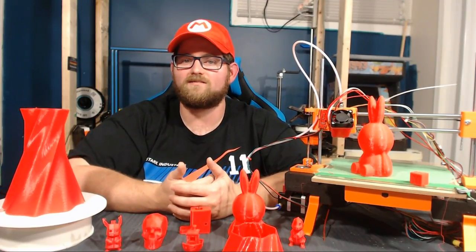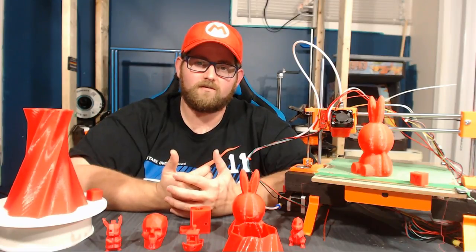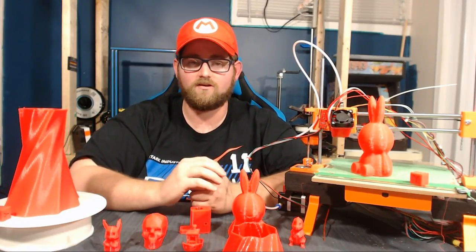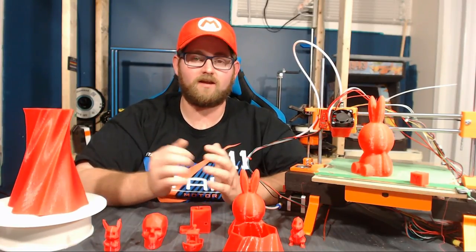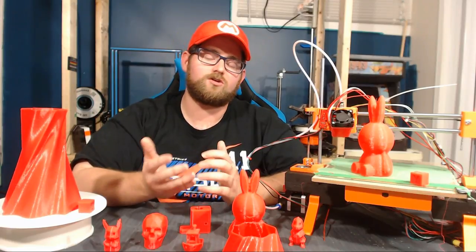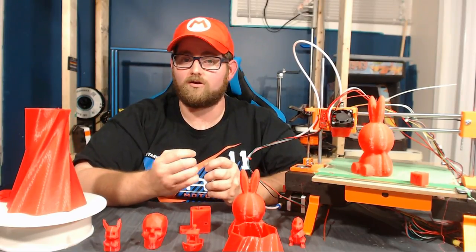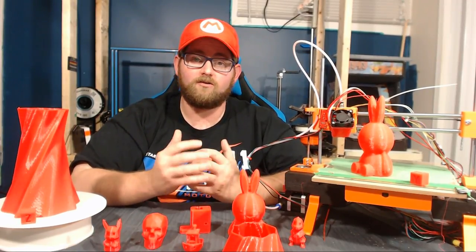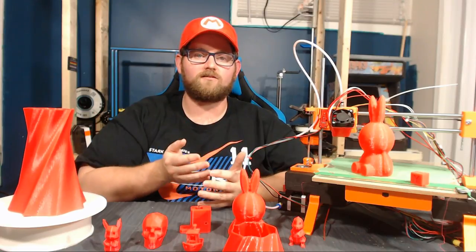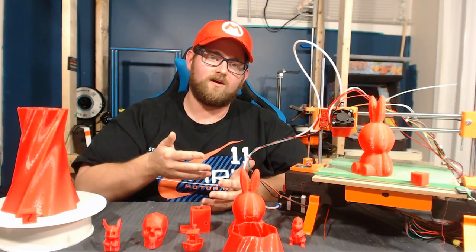So is it a good printer? I think it is. I enjoy using it, and I got a certain amount of satisfaction every time I made a change that resulted in better prints. Is it a good first printer? That depends. If you're planning to use it to build little trinkets like Pikachu or Charmander or small stuff, it's going to do a great job. But if you're looking for functional prints, you have to reevaluate — it doesn't handle overhangs or small circles particularly well, so if your functional prints require good overhang performance or fine tight circles, this isn't the route to go. I do think it makes a great second printer and a great educational piece. Building it was a great experience, and it would be good to do with a child, because it really brings you through the basics of how everything works.